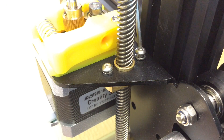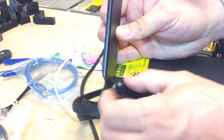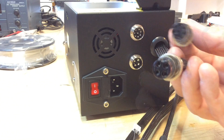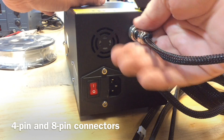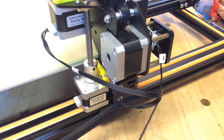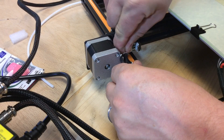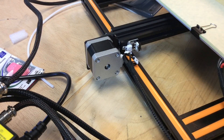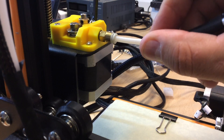While I was digging in there, I found another screw that was missing from the Z-axis nuts, so I put that in place and tightened it up. Then I installed the spool holder, which goes on top of the electronics box with some hand nuts. There are two connectors — a four-pin and an eight-pin — that just push in and screw in place. The rest of the electronic connections are X, Y, and Z. The X-axis had a motor, a switch, and the extruder. I used needle nose pliers to get the Z stop switch connector in since my fingers were too fat. Then I got the Y-axis connected and the electronics were hooked up. All I had left was to slide the Bowden tube into the extruder, and then I was ready to turn this thing on.